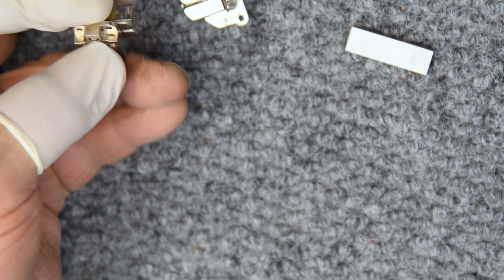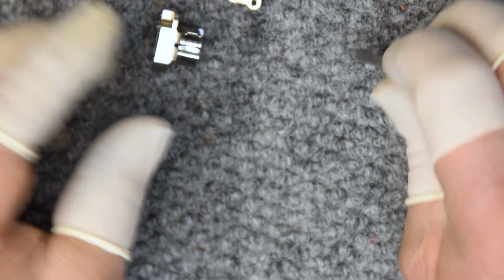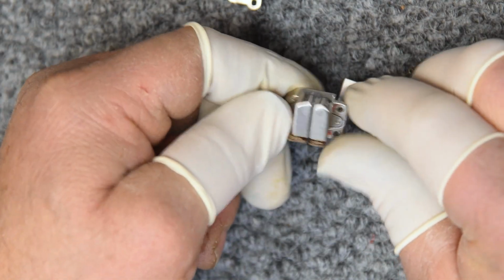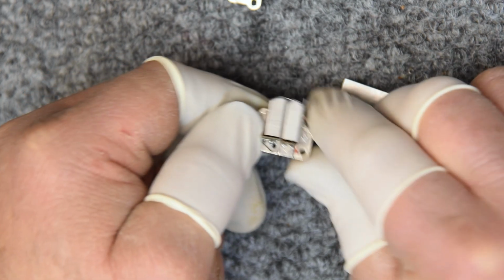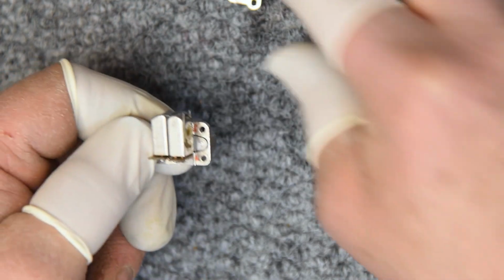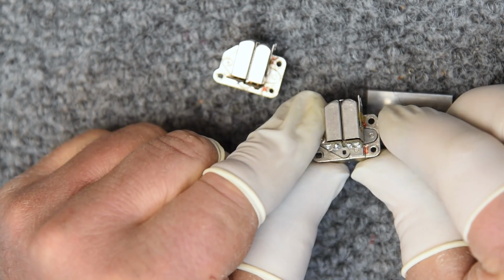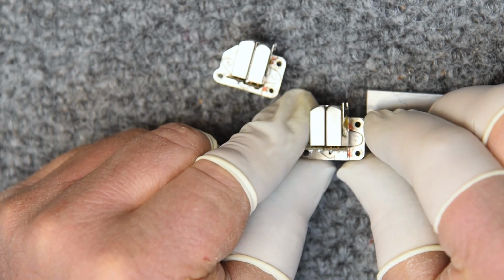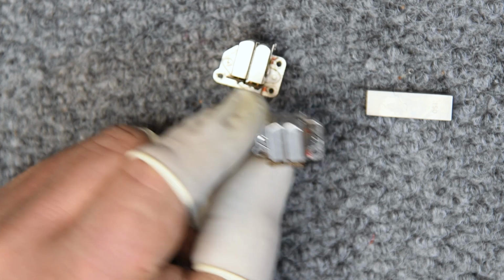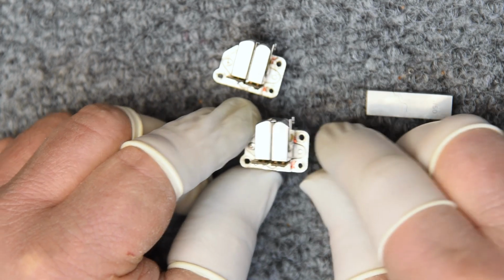The other big problem with bending guides, obviously, is not breaking them. But when they're bent back, they don't necessarily go back in the same position they started from. Bending sheet metal is not a precise thing when you're doing it with a pair of pliers or needle nose pliers, whatever. And so maintaining the correct gap is another issue.